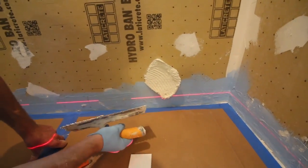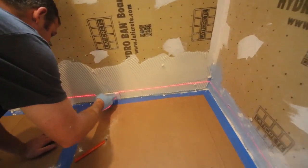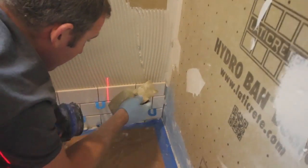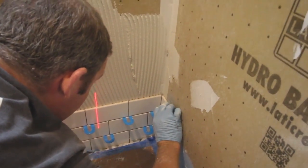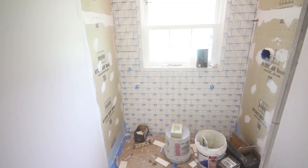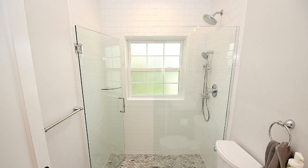We applied thinset to the bottom of the drain — not filling in the weep holes — then spun the drain into place and squared it with the back wall. We added a scratch coat then directionally troweled white thinset, building up the shower entrance so the mosaics would be flush with the main bathroom floor tile. We used white thinset because gray thinset can discolor marble. We're really happy with how the leaf mosaic turned out. The next step was to tile the walls using 3x6 subway tiles with a Dewalt laser level.